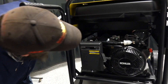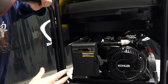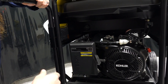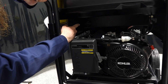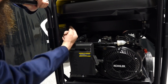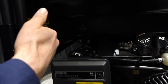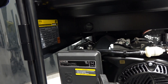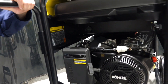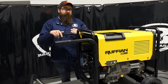In the back there's an hour meter. Kohler recommends changing the oil after the first 5 hours of runtime, and then every 50 hours after that, so it's good to keep track. The hour meter is tucked underneath, out of the weather. We have amperage ratings on a sticker on the inside, giving you output info for stick welding and generator power.